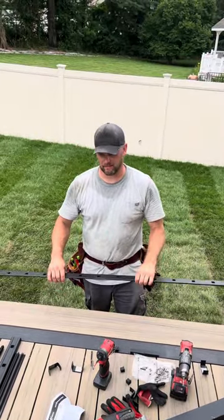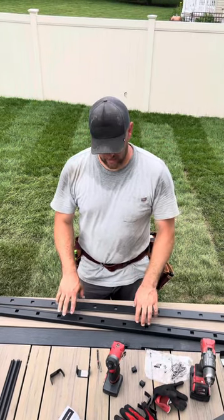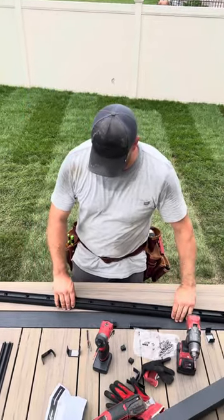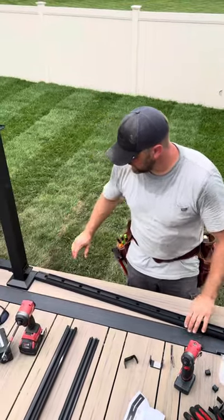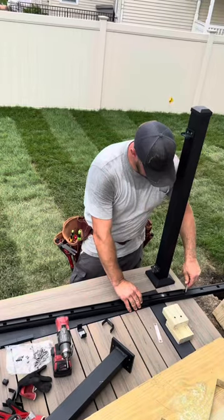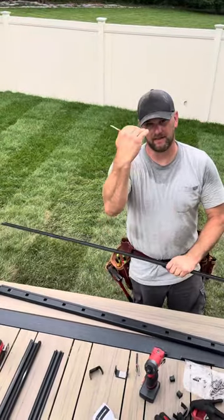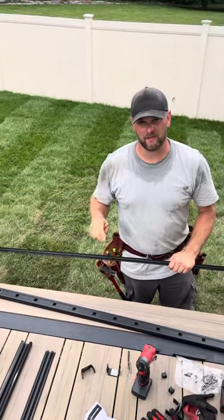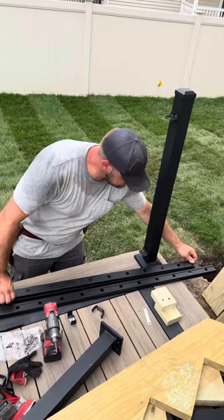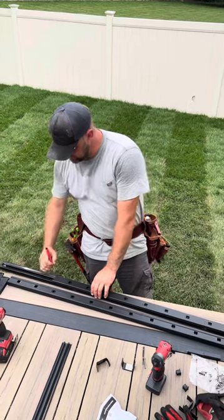This is the top of the bottom rail, so now I'm going to go cut the bottom of the bottom rail. Now that my bottom rail is cut, I need to transfer those lines over to my top rail. The way I do that is I just take it, flip it over, and line up the holes — mark the end and mark the end. So now I know that when I install this at the top, both baluster holes will line up exactly. I just put it on, make sure that end is lined up, and then just transfer the line on this side.